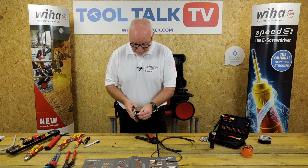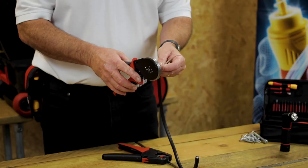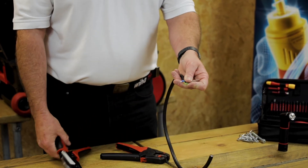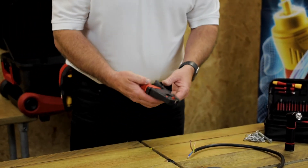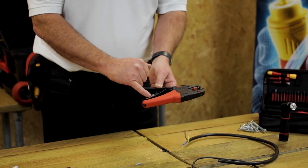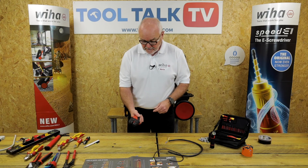So what we do now — in there, click once, go to the cable that you want to put the ferrule on, straight into the job. That's a nice hexagon, solid, full grip. For spare parts in here, you have special teeth and a rubber buffer, just to save the pressure when you're going.